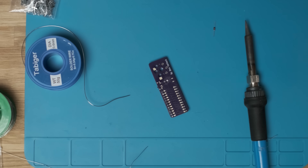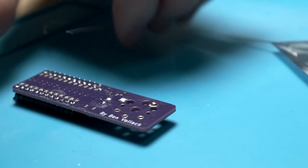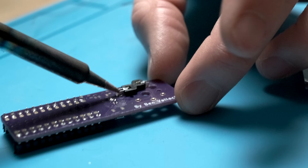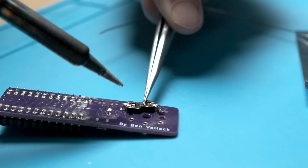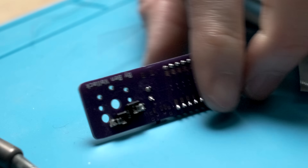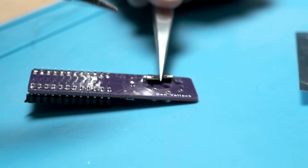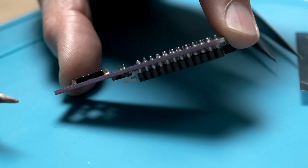Now let's get the hot swap socket switch on the back. We flip it over and add some solder to the pads — make sure you've got lots of flux and the heat is reasonable, as this is a bigger pad so it can take more heat. Apply good downward pressure so the socket sinks into place as soon as the solder is reflowing. These hot swap sockets need to be completely flush on the back of the board — they've got little pegs underneath that sink into holes in the board to keep them in the right place. I had to do this a couple of times, keeping that downward pressure until the solder finished reflowing. Now we can see it's dead flush with the board with no gap underneath.